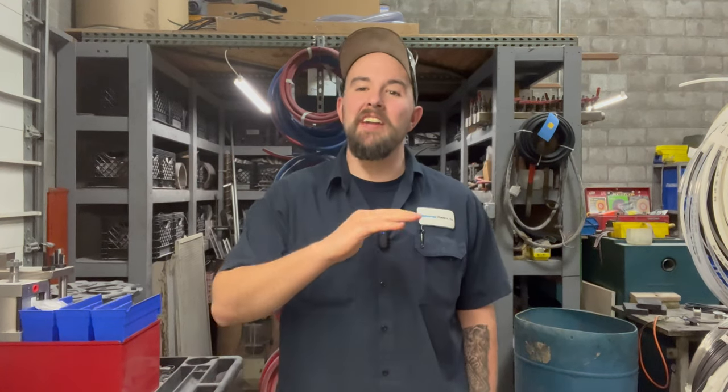We're back in the shop so I can explain a little bit better what you just saw. That machine is a continuous extrusion blow molding machine. When I say continuous extruder, that means the screw that's doing the plasticizing inside of that barrel runs nonstop — it continuously extrudes plastic, and then it's cut off at the top of the mold. That's what allows it to be pulled away from the parison coming out. This is a continuous process that never stops. As long as you feed that monster, she's pumping material out of the head.